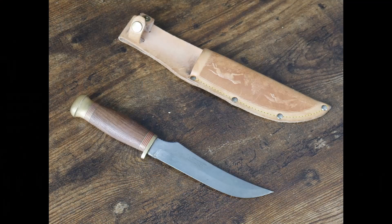So now that you know my two preferred methods of protecting against corrosion, here are some tips to keep in mind. First, clean your knives quickly after every use. Whittling on a branch doesn't require a full scrub down afterward, but a stint cutting stakes does. Make sure to take care of your blades as soon as you can afterwards. Second, make sure that you dry your knives immediately after washing. Water only accelerates corrosion. I made the mistake of leaving a Swedish Mora knife out to air dry.